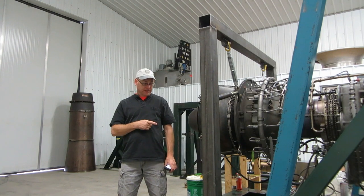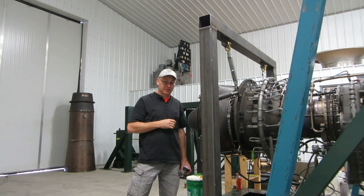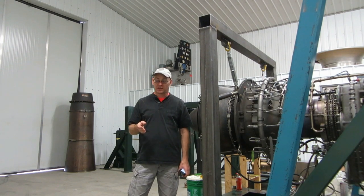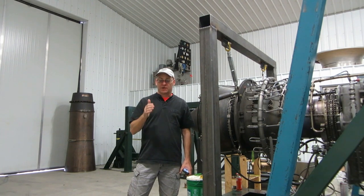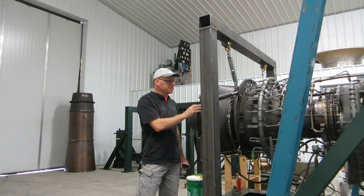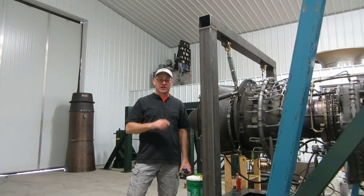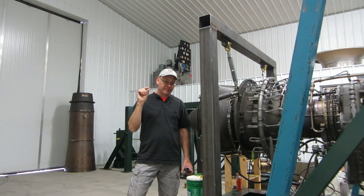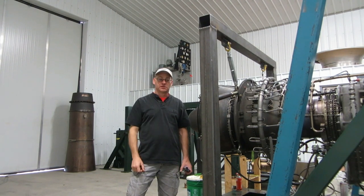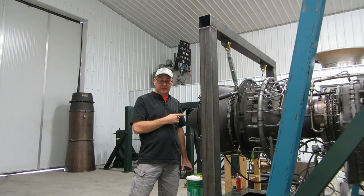That's why gas turbines are great for airplanes, ships, and generating power — any application with a constant demand for high power. As you throttle down a gas turbine like this one, 5,000 horsepower, the fuel consumption goes down a little bit, but not by as much as you want. Whereas a diesel piston engine, the power made is almost proportional to the fuel used. When this engine is idling, it's using about 30% of the fuel it uses at full power — a lot. They don't get as efficient as a piston engine until they're in the top 5% of their power range.